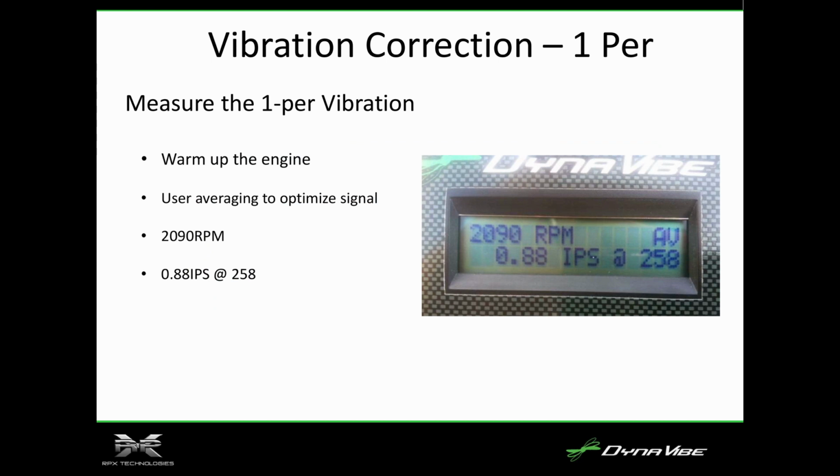We warm up the engine. The system gives you the RPM, which is great to check the instruments. My Kitfox has an electric tachometer, and every time the beacon fires, the tach goes down. So you know it's wrong because it's based on system voltage. Well, you can always check it using this system, which is completely separate.